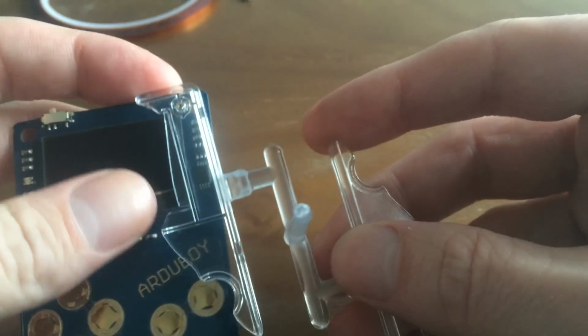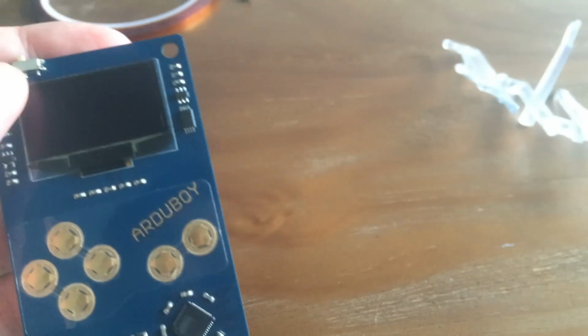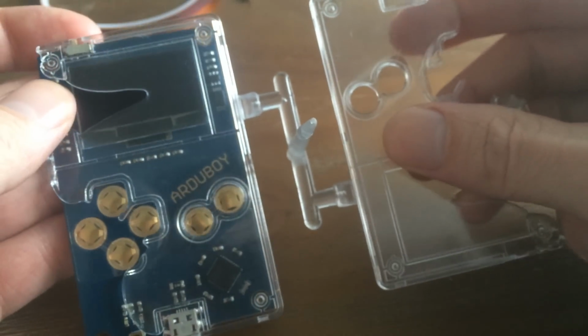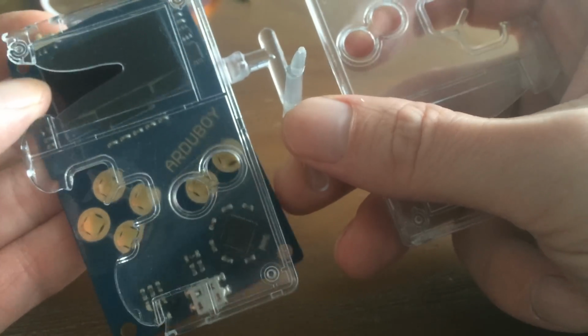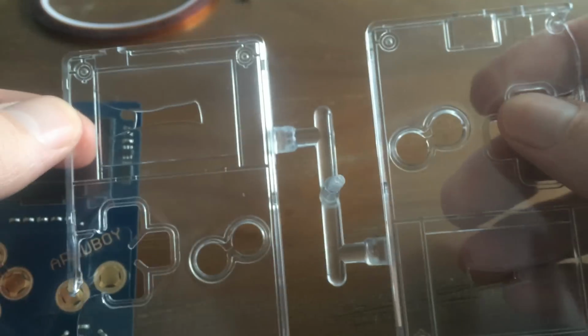So you can see, it didn't quite make full coverage. The second shot that we did produced a little bit more. Every time we do a shot, we're changing values on the machine to adjust the temperature, the pressure, all these other values in there. So you can see that this one gets a little bit closer. And each time we do this, there's things that we're looking for.